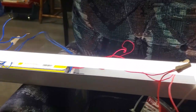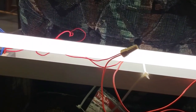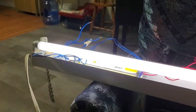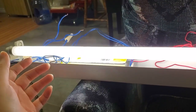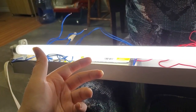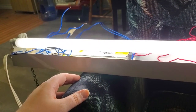Oh, interesting. What I saw was that the cathode almost had a very quick preheat-type behavior - the cathode glowed pretty brightly and then the lamp started. Ballast works great, lamp looks great. Let's start it up again and observe that again. Yeah, it's almost preheat-like. It very briefly preheats the cathodes before it starts. I wonder what the methodology is - is it actually programmed to briefly preheat the cathodes before it starts, or is there just an inherent delay before it applies the high voltage?